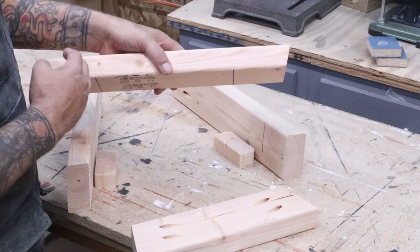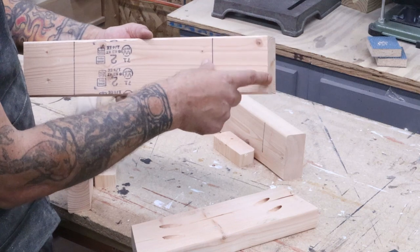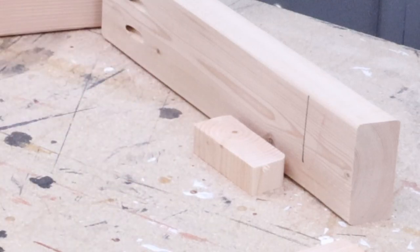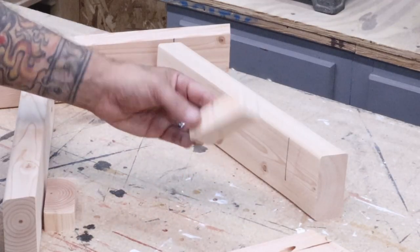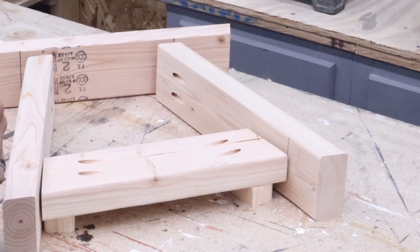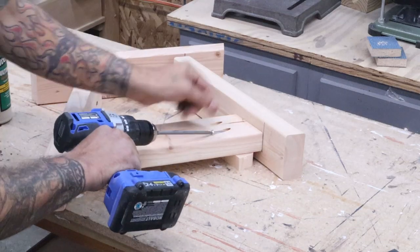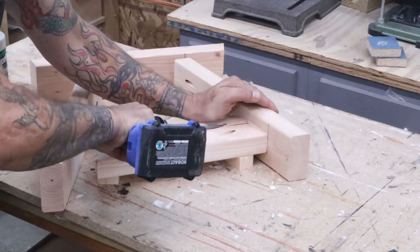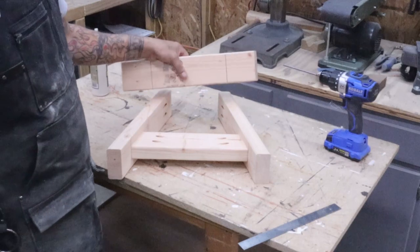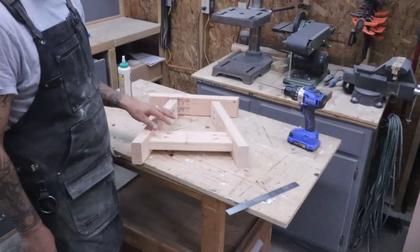To assemble this thing, we take the top rail with the long edge on top, flip it over, and put a mark at three and a half inches in from the beveled edge. Then we come up two and a half inches on the legs and put a mark. I cut these two-by-fours as a shim — they're an inch thick — so when I put my center support on it'll be dead center on the two-by-four. I'll line up the bottom edge to the line, glue it, and pocket hole screw it. I'm using Titebond III because it's waterproof and two-and-a-half-inch pocket hole screws.